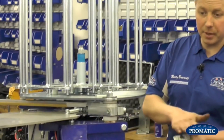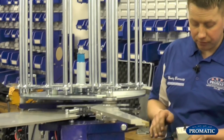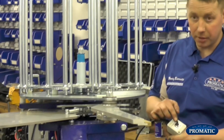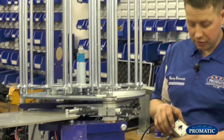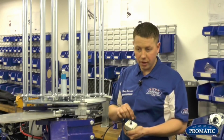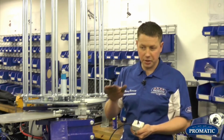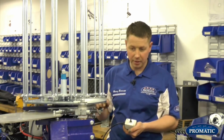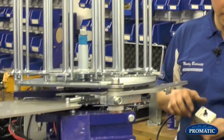So we'll go through that again. We'll disarm it, bring it round, so the arm is sticking straight out in the front of the machine. We will arm load it, so take it straight down to arm load. Now you see the machine is cocked. We'll take it up to off. A lot of people think when you turn the machine off, for instance, if you're filling the machine and things like that, off is safe, but the machine's still dangerous. It may be there's no power coming into the machine, but it could actually still fire. So we'll disarm it.